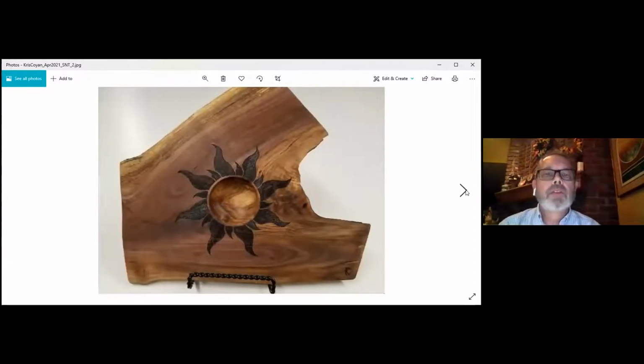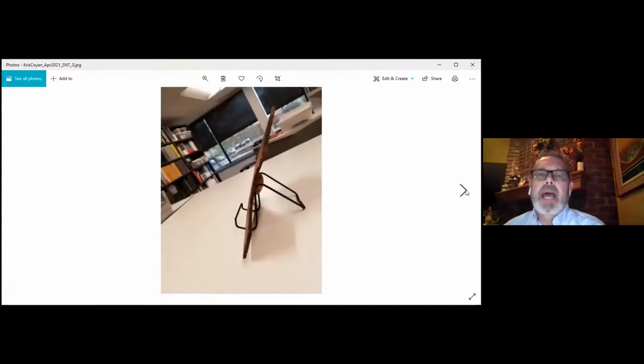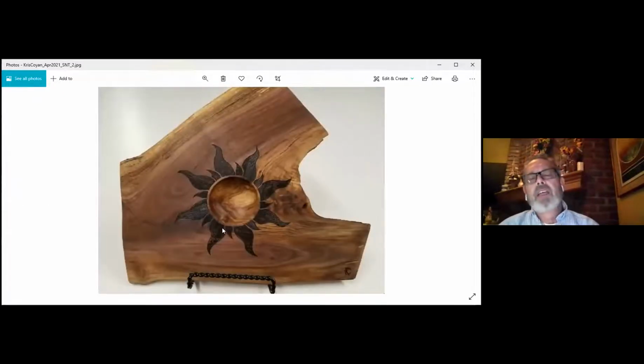Yeah, this is just one of those crotch pieces, turned thin with a bowl in it. Only the piece of crotch that I had, this was the back half, and it was only about 2.5 inches thick at the thickest point. So in order to get a full half sphere off of it, I had to have a pretty small bowl in the center of it. When I was done, I was dissatisfied with the look overall. Of course, I was trying to capture that feather grain going through there. But what I was displeased with was the proportion of the bowl shape to the rest of the log.